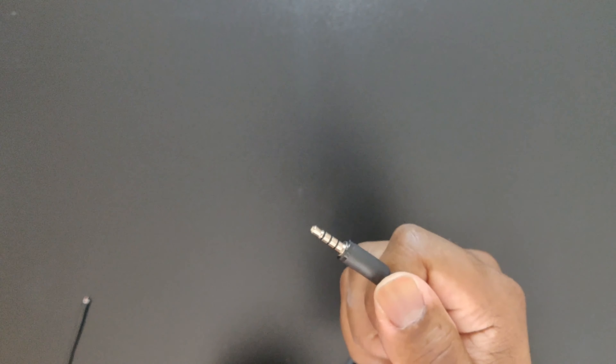You don't have to twist these up too much — you just want to make sure they don't fray apart. Just give them a little bit. Go ahead and grab your banana plug — make sure the red matches. Put it in there. At this point you want to fray the ends over, bend it down. It's like a little lip, so make sure you tuck it inside the lip. Go straight through the back here, bend it over the lip, then grab the top, put it on, and screw it down.